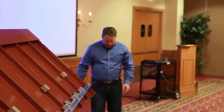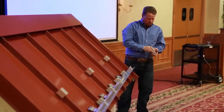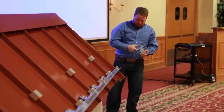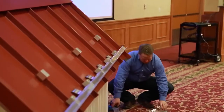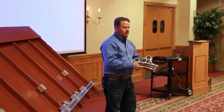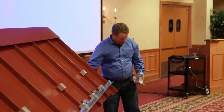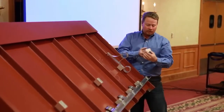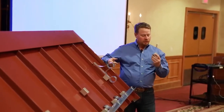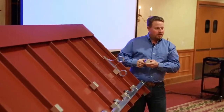My clamps are in place. What I've found works best with this product is to start my clamp in the bracket, then add my second clamp. This utilizes two clamps, which is part of why it's stronger. I'm going to go ahead and preload, making sure my set screws are on the right side — on certain profiles it is critical that your set screws are on one side.